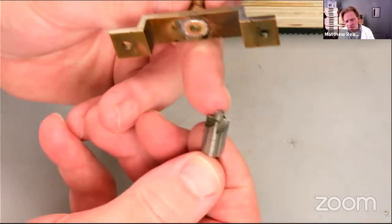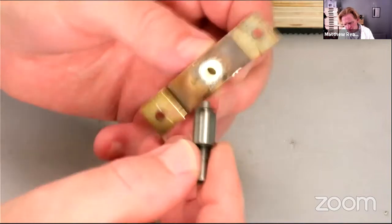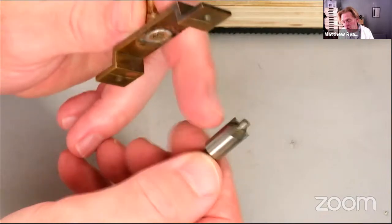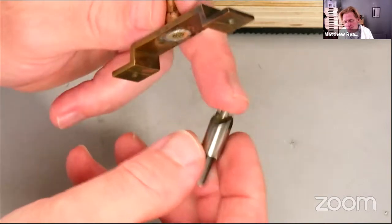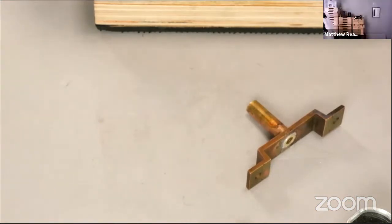But the thing is here, it's got a center look that normally is a good fit inside the hole. So if I tried to use this to cut away material there, it's just going to wobble about like this. Maybe I can use it, but you can make these, if you think about it. All this is a cylinder of steel, drill the middle, get a file, and file these 3 or 4 bits of relief. I've made loads of these. It's a bit of a faff, but if you want an end cutter that's a specific diameter with a specific center, and of course you could just make a bigger center for this as well to locate it. I wonder whether we can actually use this. I'll just check it's big enough first. Yeah, it would be. Let's have a little look at that. Save me mounting it in the lathe.